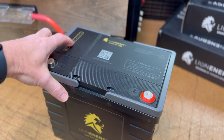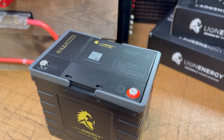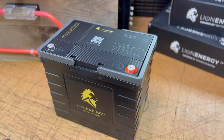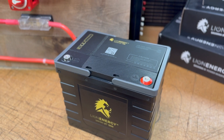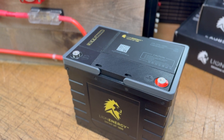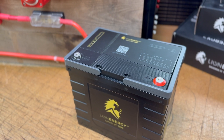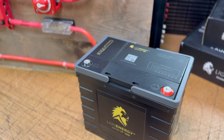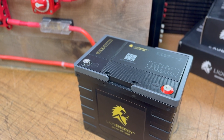There also needs to be a visual or audible means to indicate if the battery is potentially going to shut down. The LED indicators here actually serve that function. Furthermore, in the app itself, being able to monitor the battery remotely serves that function as well. The case is relatively well sealed — it has a gasketed lid around the lip. So though it's not waterproof, it is certainly splash proof. I keep mine mounted in a dry location, and even in a box on the sailboat as an extra measure.